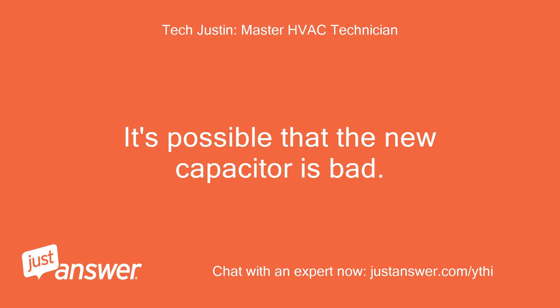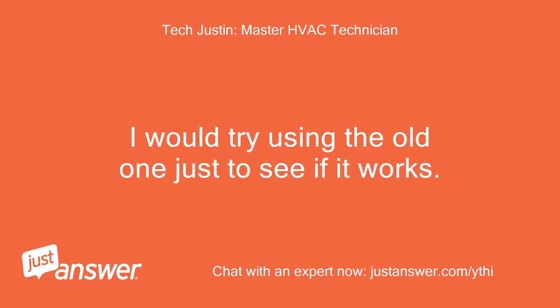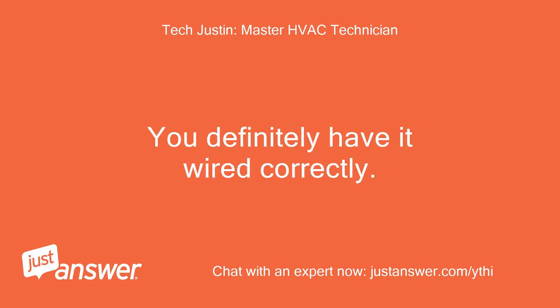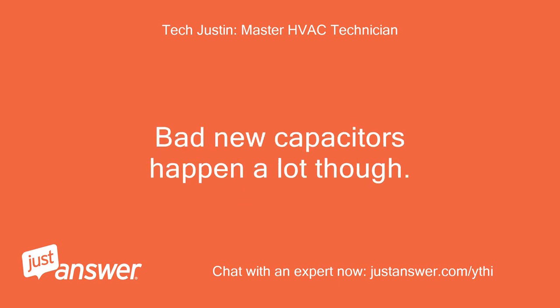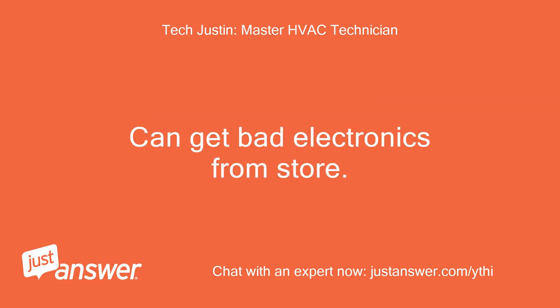It's possible that the new capacitor is bad. I had a bad one the other day. I would try using the old one just to see if it works. 1 MFD won't hurt it for a few minutes. You definitely have it wired correctly. If that doesn't work, I will step out and let another tech help you. It's very rare for a new motor to be bad, but it could happen. Bad new capacitors happen a lot though. Just like with anything else, just because it's new doesn't mean it's good. You can get bad electronics from a store.